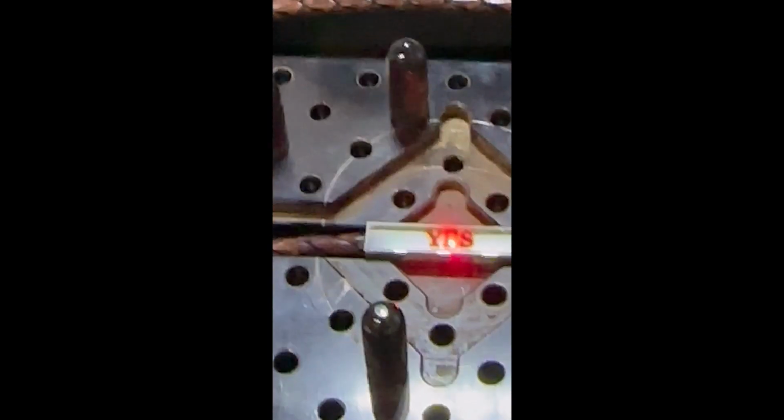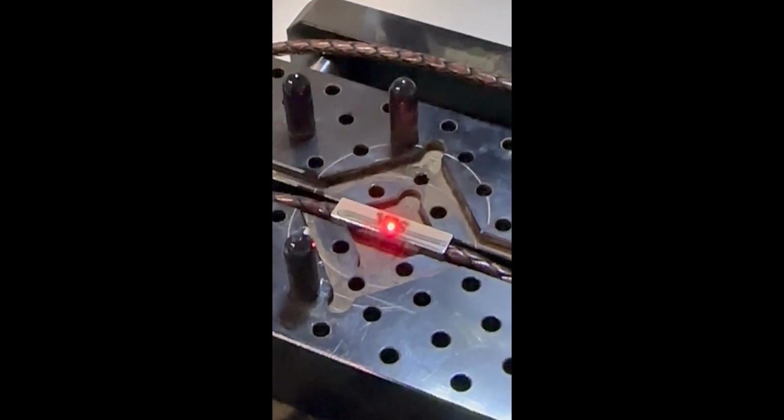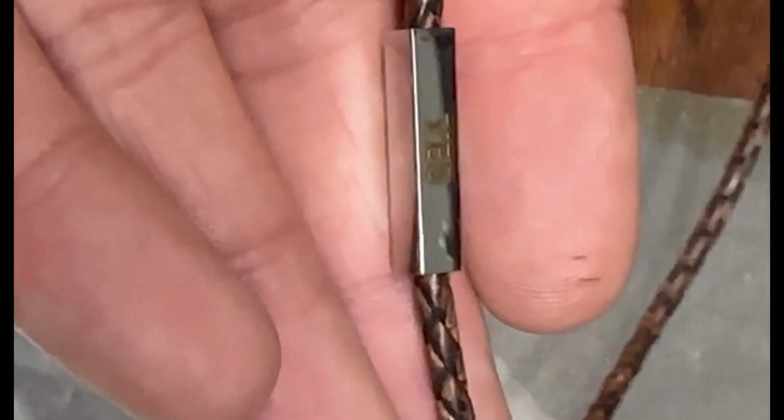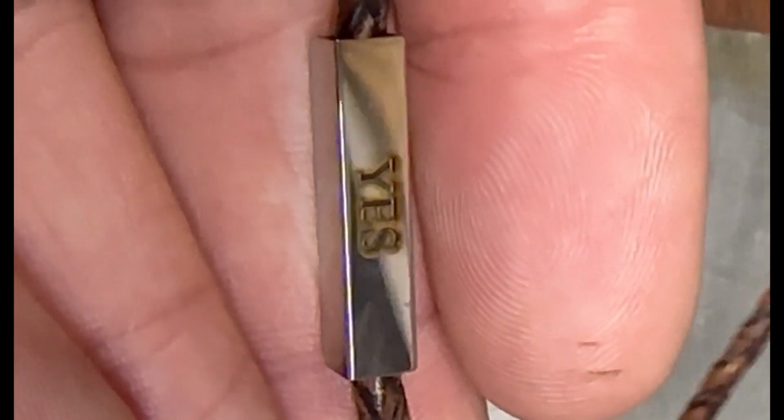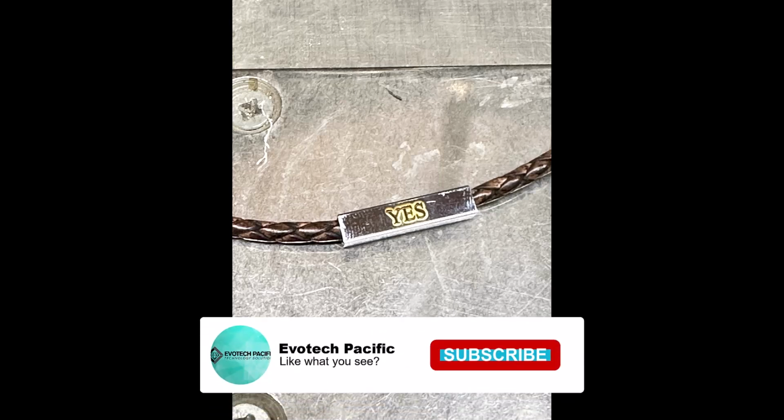That square that you can see around it, that's the preview square, so we just click that one off, and you can see that that's cut into that metal really quite nicely. So when we take it off the machine, you can see that the oxidization is there. It's a really dark oxidization, and you'll also notice that the oxidization is still around the outside of the engraving. Now that should be easily removed by either a silver cloth or a gold cloth, or perhaps polishing it on the buff and giving it a quick ultrasonic.